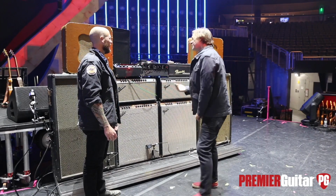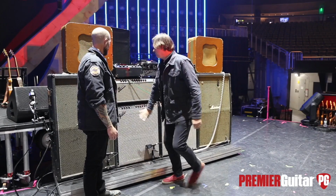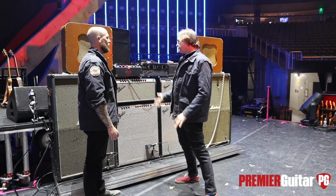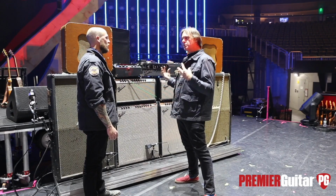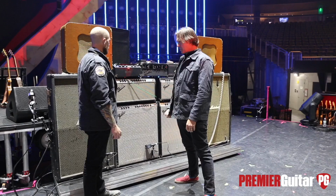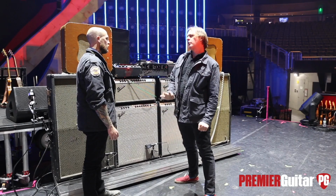We went back over to the studio, set this up with one of each, and did a bunch of testing with pedals and stuff, and loved it because it's a much softer, squishier, browner sounding. What does that tube rectifier do? Yeah, it squishes and it's softer and it's slower responding.